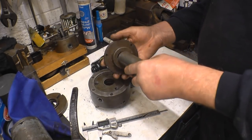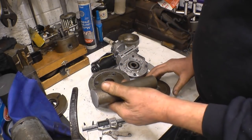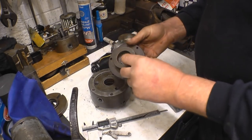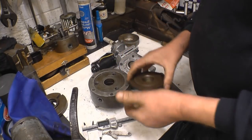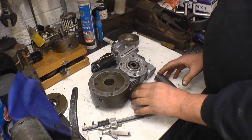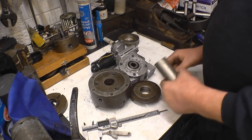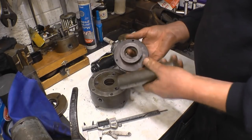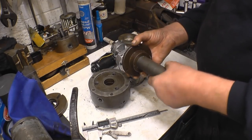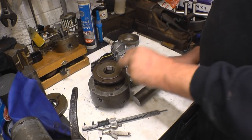I've got some inch and a half round bar that will go in there — I need to cut that thread on the end. I can cut the imperial thread on my Harrison metric lathe; I did make some changes to allow us to do that. There are several ways of doing this but I like screw cutting — it'll make a nice little video. I'll set this up in the lathe and get the thread cut.